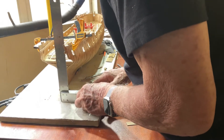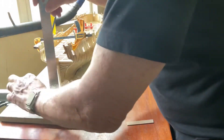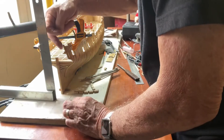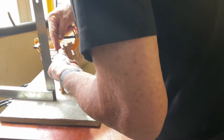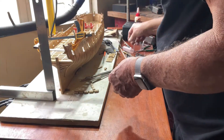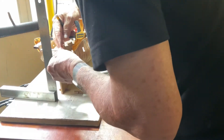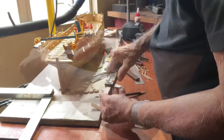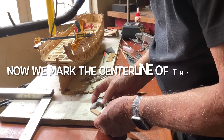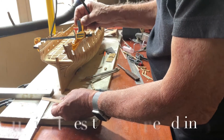We're taking the inside measurement and we've marked it down here, and the same thing on the other side, so now the inner side of both of these is exactly the same. Then we can slip this piece in, mark it, and mark the centerline of the bottom. We measure inside, and when we put it on, it shows we're still off the centerline — so all we're doing now is pulling this in.